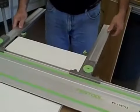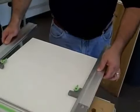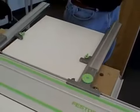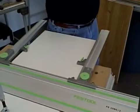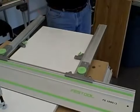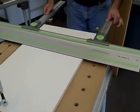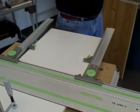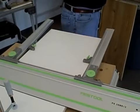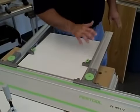Now I can take this unit, make my cut, then take it to my next piece and do the cut. All my sides are going to be 330mm no matter what. I'm going to have a square box — top, bottom, and side. The cool thing about this is I'm not moving a big sheet good in and out of my fence. I'm just going boom, boom, boom down that sheet good. I don't have to move it into the lumber rack, move it on my cheater table, through the saw. I can do it all right there. And it's precise, accurate, dead on every time.